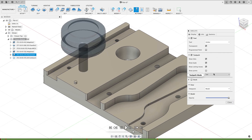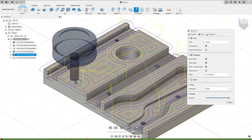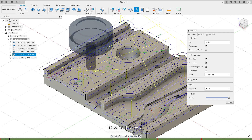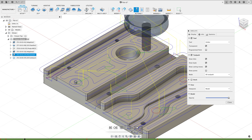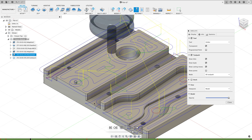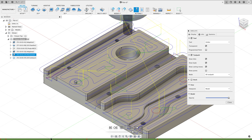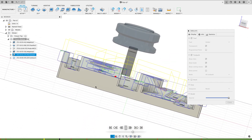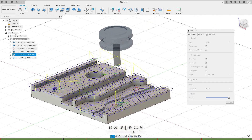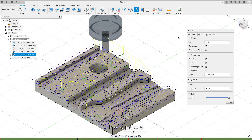If I simulate this with no stock and set it to all toolpaths, you can see the annoying thing — it doesn't really match the geometry we're trying to machine. It's just doing a boundary and stepping over, and towards the end of the toolpath it always makes this outside trace over all the features. It can also be difficult to get it to machine over open pockets and open holes, so you'd have to create a patch surface. It seems like it's wasting a lot of motion, and I haven't been a huge fan of 3D Horizontal.